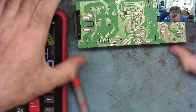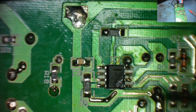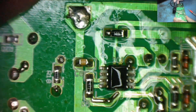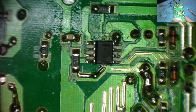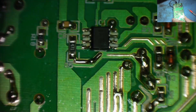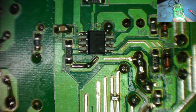It's down to 0.4 volts, so it's safe to work now. Let's have a look to see what this chip is — I'll get the microscope. Here's our switch mode power supply controller, the pulse-width modulator. I need to clean a bit of gunk off and then read the part number. It says '1207A' then 'PCJH', so 1207A is the part number — let's find a datasheet for that.